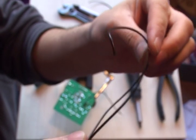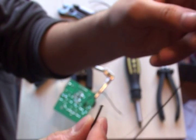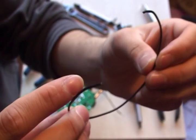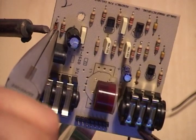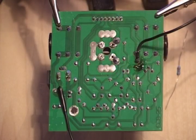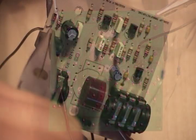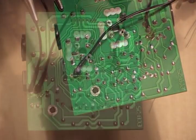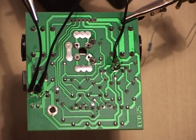Now you're going to cut yourself two bits of wire: a long piece running from the positive connection on the PCB just north of the resistor, running to the anode or long leg of the LED; and then another piece of wire running from the negative point on the PCB just north of the diode, running to the switch. What worked best for me was to unsolder the back of the PCB for one leg of the diode and one leg of the resistor, pull one side out, then put in the wire you want to attach into the back of the PCB. On the front of the PCB push the leg into the wire and solder it all together. The two wires on the left are the positive and negative power for the LED, and the one on the right at the top is your clean input signal wire.